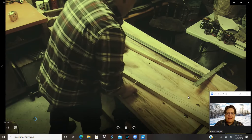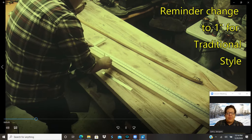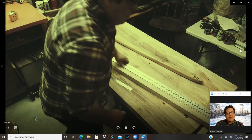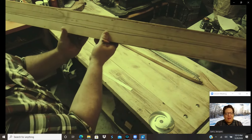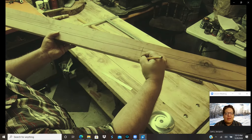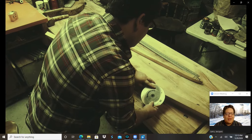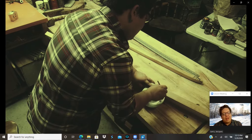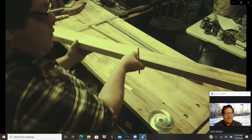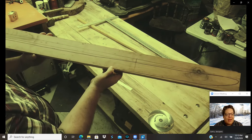Then you're going to see that second cut that I'm marking. On that second cut, if you want to change to one inch above your 0.25 inches of waist for the more traditional style — I'm going for the thicker style because it's just more mass that I get to put down the track. I'm stopping short of where the line actually intersects with the part of the snake we're keeping, because table saws cut further into the wood, so I don't want to make any table saw marks on the actual snake itself.